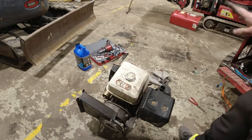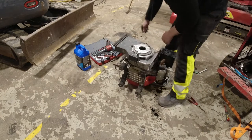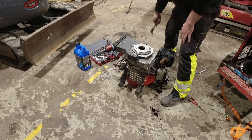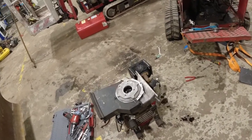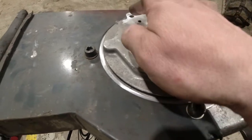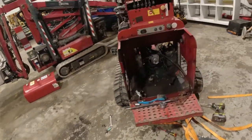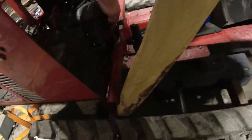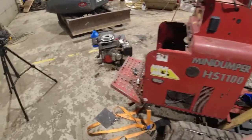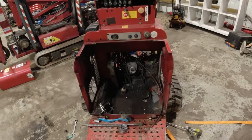It is rubbing a bit but it is what it is. Let's just wrap the bolt in. One day I probably need to buy this one new - not only because of this but also the holes here for the pump are really worn out. My quick fix for that was to install an engine mount under the pump for holding it up, because those four bolts were everything that was holding the pump. This thing vibrates and everything, really difficult. Got a lot better when I did that. Haven't had any problems after the engine mount was installed.